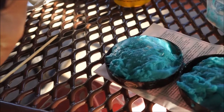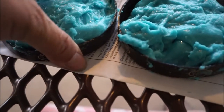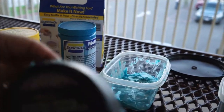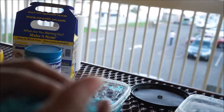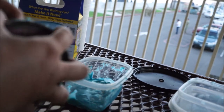Cure time is 30 minutes, so we're going to leave it alone for 30 minutes. These I had to smear on at the end because the material had gotten too hard. I don't know what it looks like — I kind of smushed it in, which is not what you're supposed to do. You're supposed to pour it in. That one got poured okay, but this is the fast cure, so it cured pretty quickly. That's why we can do this — usually it takes four hours.